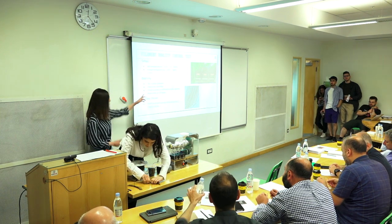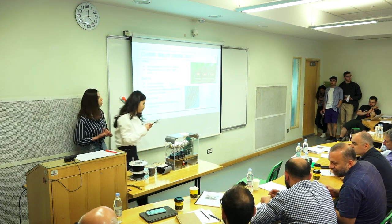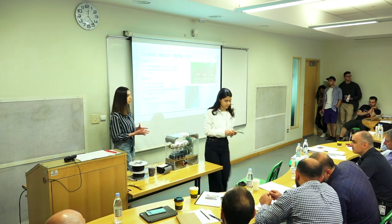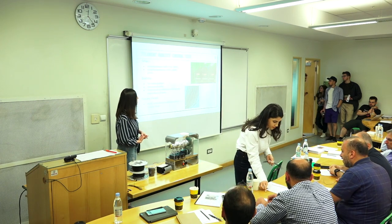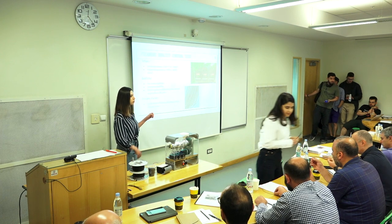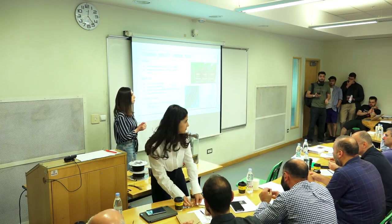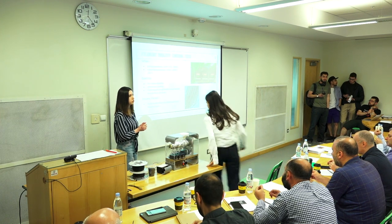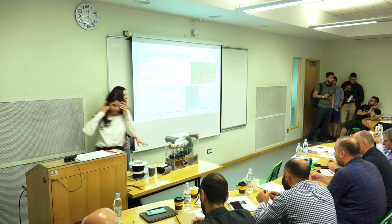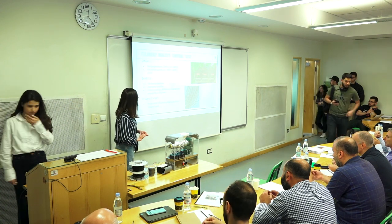Okay, so in order to address the issue of the bad quality, and also because of the issue of the middle controller having very high values, we decided to do another approach. So we set the value of the middle heat controller to a value lower than the room temperature, so that the relay connected to it would be in a normally open mode at all times, and the heater wouldn't heat up.